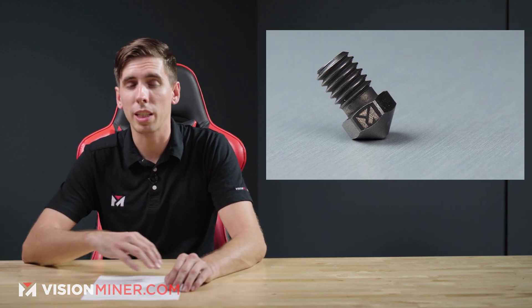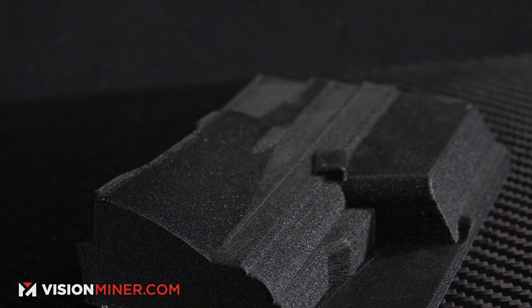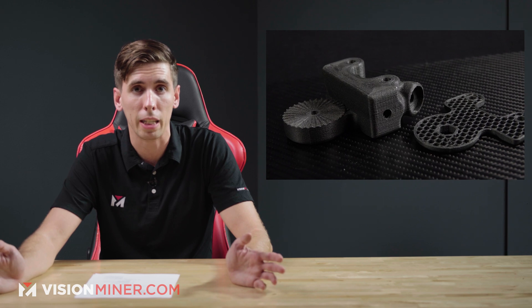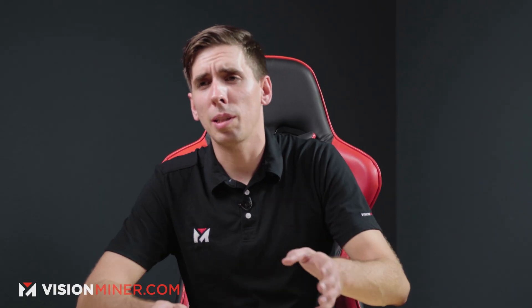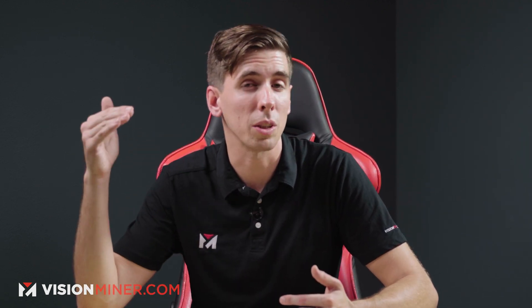Hardened steel you're going to want with any abrasive filaments — this generally includes carbon fiber and glass-filled materials, but also pigments like titanium dioxide found in white filaments. That will wear through a brass nozzle fast — with carbon fiber you've got about 250 grams before brass goes out of spec, whereas hardened steel lasts multiple kilograms. Even semi-crystalline polymers like PEEK can be abrasive. One thing to remember: hardened steel has lower thermal conductivity, so crank the temperature up 10 to 20 degrees Celsius.